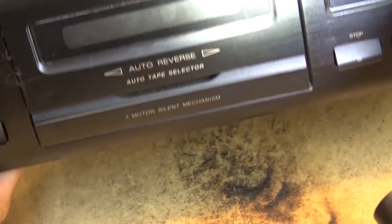One thing I didn't check on this unit is whether it has auto reverse recording or not. We'll check that out once the tape's rewound. Does this have auto reverse recording? I bet it does. You can tell just by looking at where the erase head is — if the erase head actually rotates with the record/play head, which it does. You can see it here — when you change directions, the head turns around and the erase head is ahead of the record/play head, so it will record in both directions. Playing back my existing recording, the left channel still sounds really low, so further cleaning of that head is necessary.